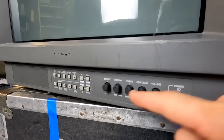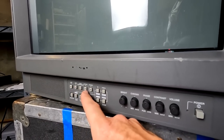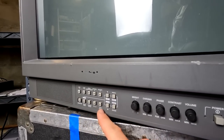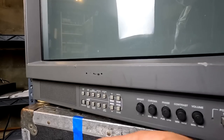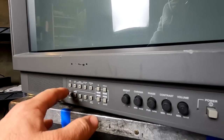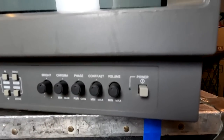The 20L2 has a button board area that allows you to switch between your inputs and option cards, and also do a couple of monitor checks and calibrations. You have a full menu in this CRT with a service menu where you can make deeper adjustments to things like color and geometry. There are also quick adjustments for volume, contrast, phase, chroma, and brightness.